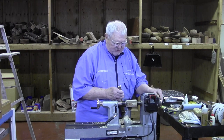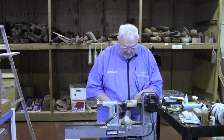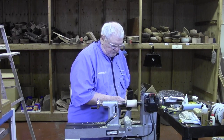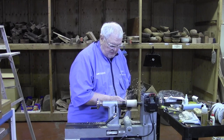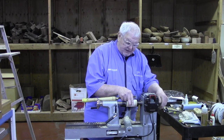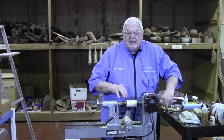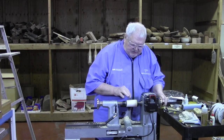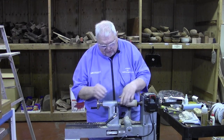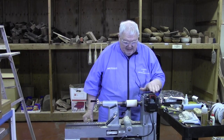Now this was square, but it's now somewhat round. However, I have almost three-quarters of an inch clearance here, which I don't want. So I'm going to turn the lathe off, bring my tool rest in to where I'd like it, and recheck it. I noticed it slipped there a second, which means the collet is not as tight as I'd like it to be. So I'm going to lock the spindle on the lathe for a second and tighten the knob on the drawbar to pull that in more rigidly. Then unlock the spindle. Since I pulled it in a little bit, this may be loose — I advanced it about a quarter of a turn. We'll go back and finish roughing it out.